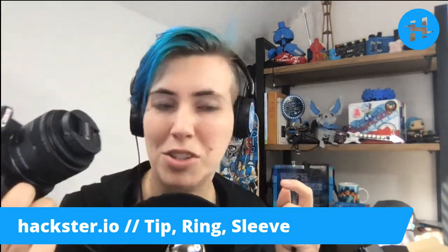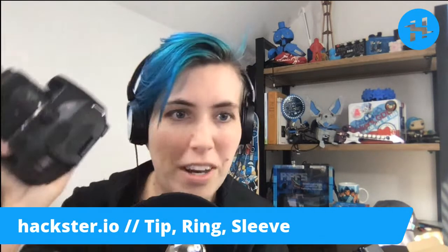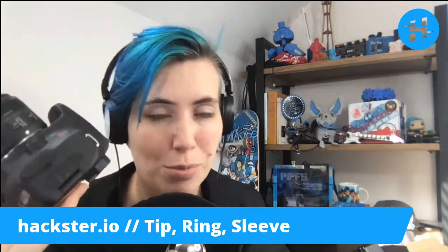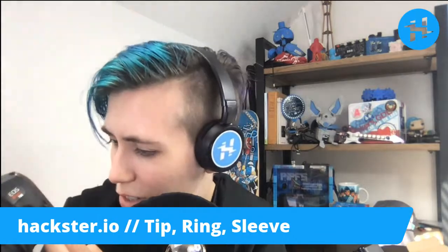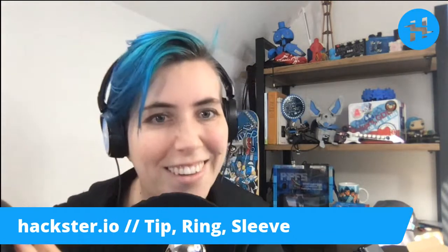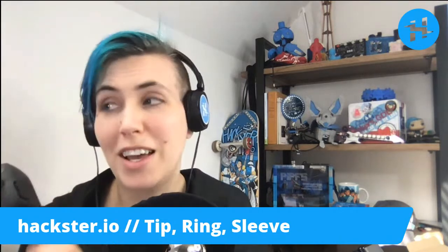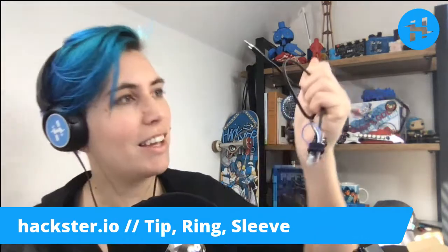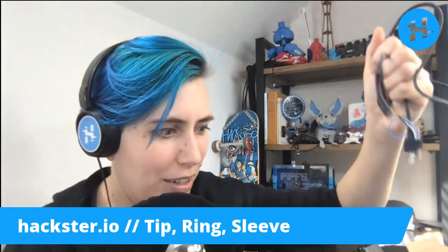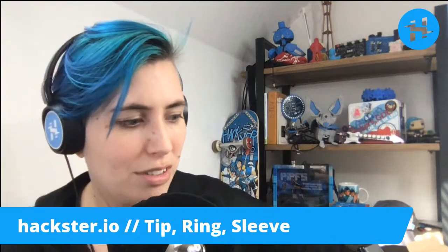So this is a Canon Rebel T8i, and the connector that it has on here is a 2.5 millimeter TRS, or tip ring sleeve. It may have more connections, actually. I should shine a light in there and have a look, or look in the advanced manual or something. Anyway, it's a whole rabbit hole, but I hacked together a remote shutter controller because I couldn't wait to order one and wait for it, or go to a store. I just wanted to get started.